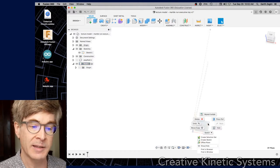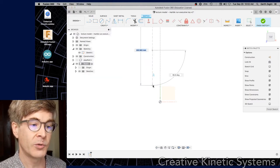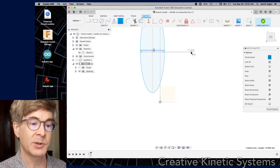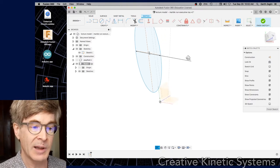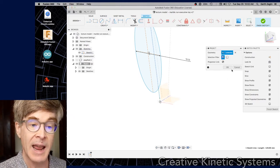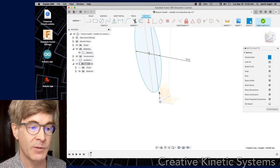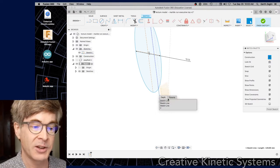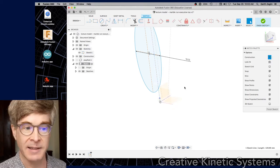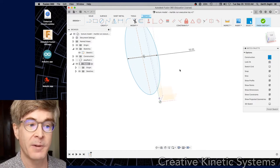Now that we're in Foot, I'm going to create a sketch on the ground plane and we're going to create an elliptical foot. I'm going to first drop it down and then do some fix-ups. I'm going to take the original sketch line and project that — the P key is bound to project because I use it so often — and project that into my current drawing. It does come in as a solid line; sometimes it's convenient to make sure that is actually a construction line. You can hold down while selecting to get a menu of possible items at that point, so it's possible to pick something hidden, then hit the X key to make a construction line. The purple line is now dashed, which saves a little on the way that profiles are defined — there won't be as many split profiles this way.